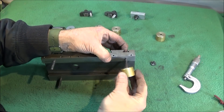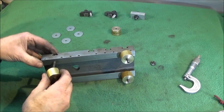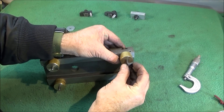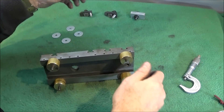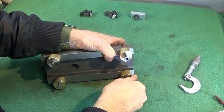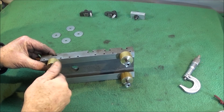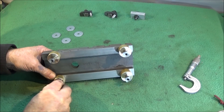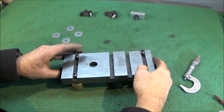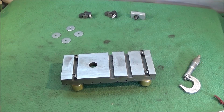The bushes go on the underside, and then the T-nuts go on the bolts. Obviously the T-nuts would be in the slots on the long cross slide, and you'd actually be doing this on the lathe. It's very easy to position up and get the bolts correct.